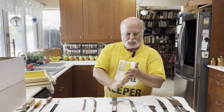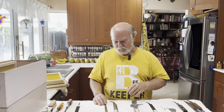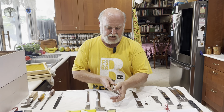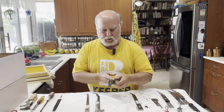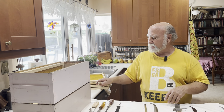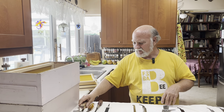Now we're going to get to the tip I promised at the end of the video. Basically we've gone through some pros and cons here. The most important thing I've shown you is bevel versus blade thickness — the shallower your bevel, that is the further back your plunge line is, the better. Just grind these back — you can do it on a regular grinder, a belt grinder, or with a file. Change your bevels so that it slips into the box better. I don't know that you're ever going to slip into the box quite as well as a paint scraper does, but it'll come close.